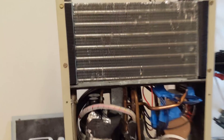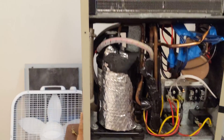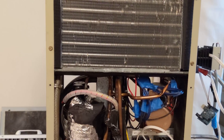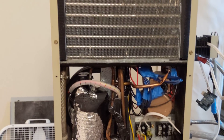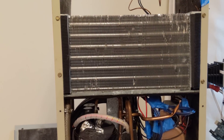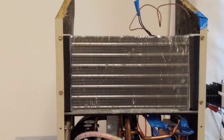I know you're going to say increase the charge, but there's really no way to do that without messing it up. And I know you're going to say increase the airflow — if you could only see the contraption I mount on top of this thing, you can't practically get any more airflow through it. So if you have any other ways you'd suggest to increase the temperature of this evaporator so I don't get frost over, let me know. Thanks so much.